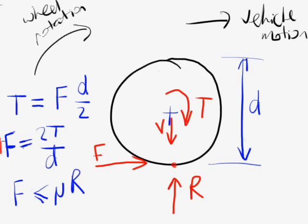The equation F equals 2T/D tells us what the traction force actually is. If the torque is so large that F would exceed muR, then we only get muR — we hit the limiting friction force, and the wheel is going to slip and spin. So the message here is that grip — this mu — only matters when you run out of it. It only matters if you're driving the wheel so hard that it's actually going to slip. If the wheel is not in a slipping condition, then it doesn't really matter what the coefficient of friction is, as long as it's big enough. So if you have a problem with wheels slipping and spinning, one solution is to increase your coefficient of friction — and putting rubber bands on the wheels is one good way to do that.